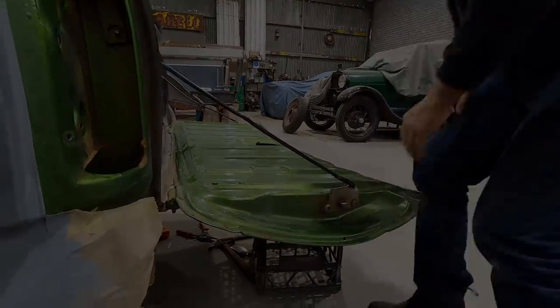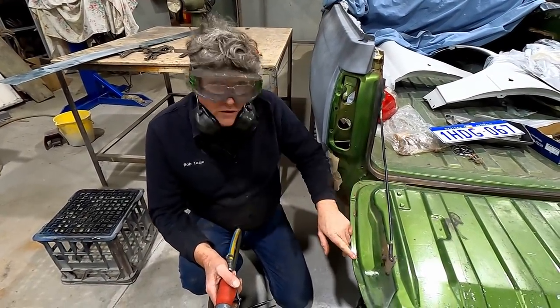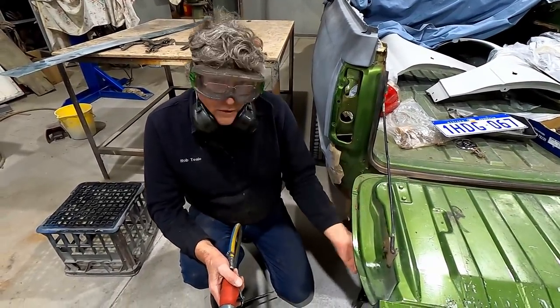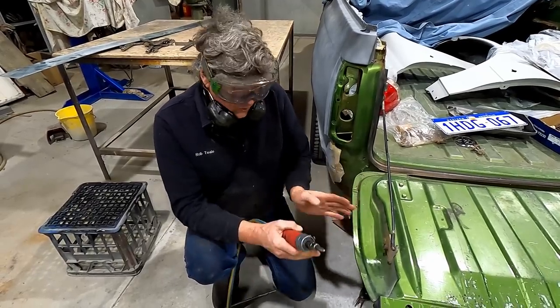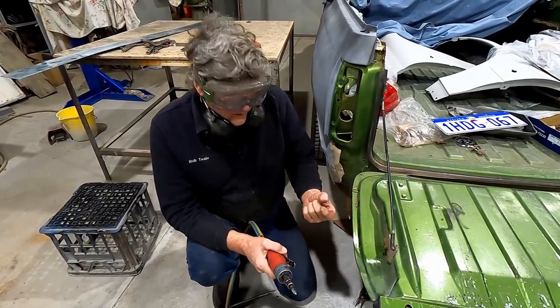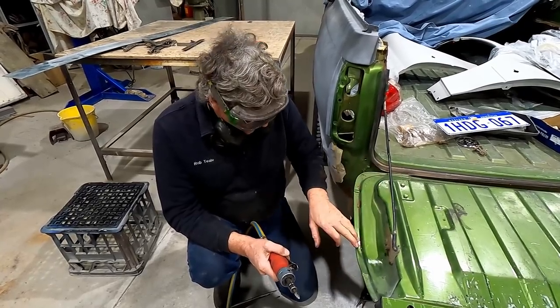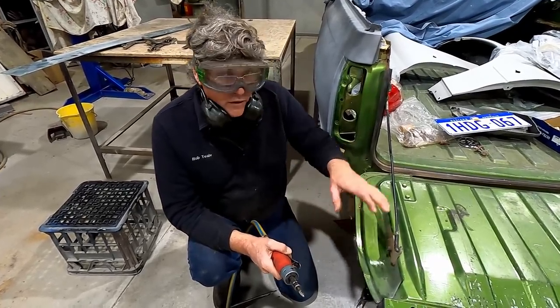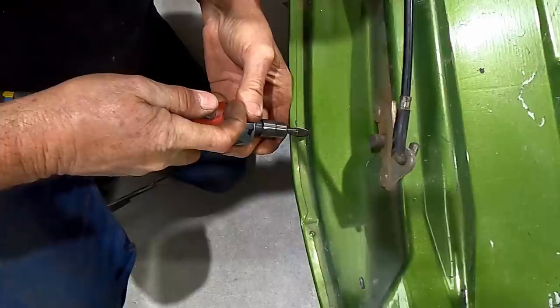I've had approximately 2.5 more minutes to think about this, and I've decided what I want to do is get some of the shape in the panel before I cut that little recess in, just to make sure that my tooling's not going to move. So once there's a little bit of a line pressed in there, it's going to stabilise itself. So for now, I'll just get this hole sorted out here. We can get the piece into the tailgate and then we can move on from there.